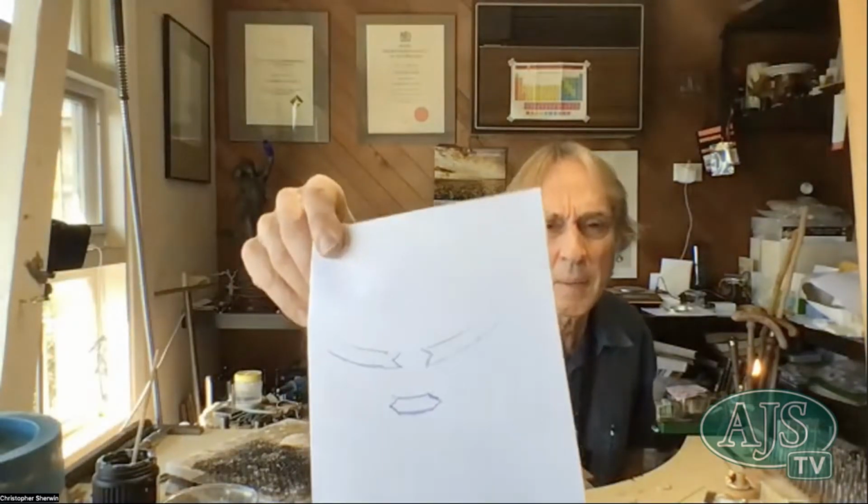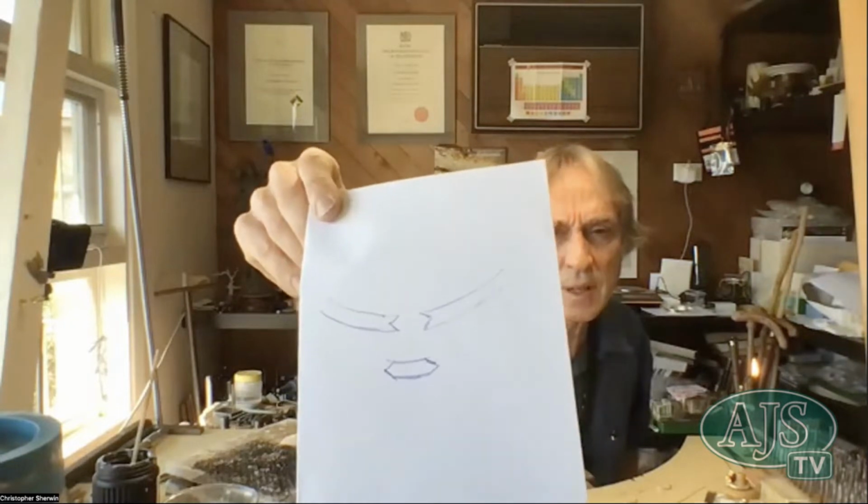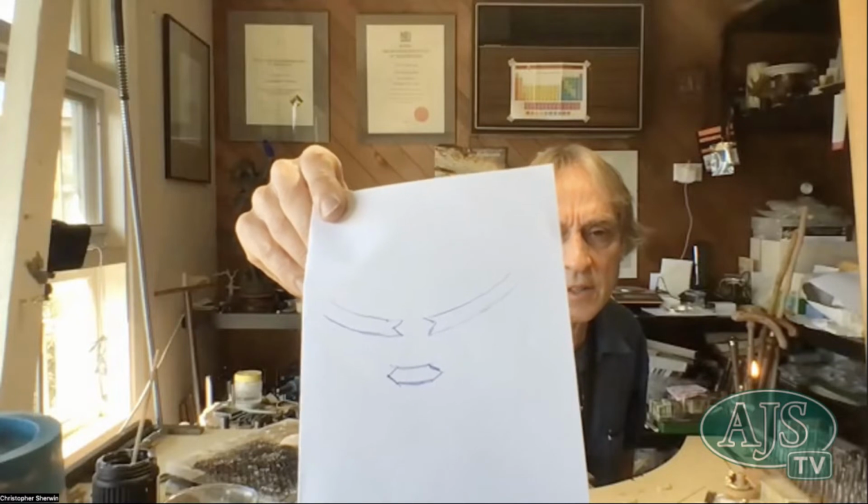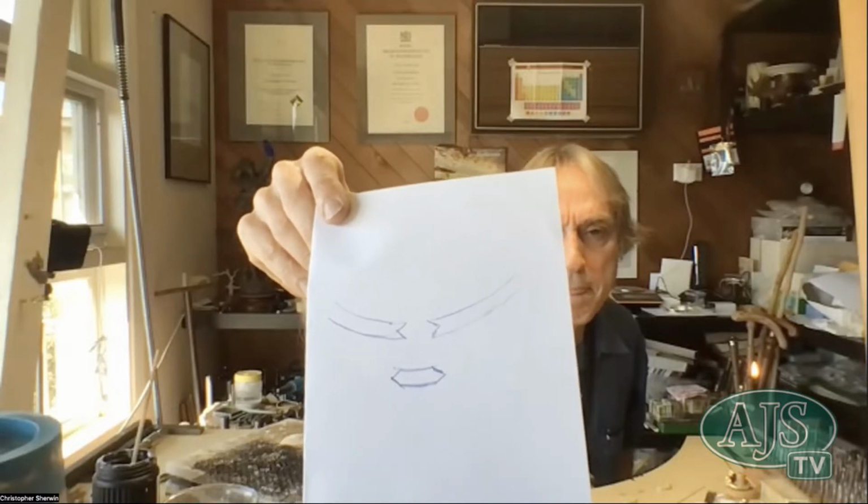I'll just show you the two sizes we're about to do. We'll do the little zigzag one first. This one is where we're going to cut a piece of metal and put a V joint, if you like, in the insert as well as the band. Hope everyone can see that. We can. We'll do that one now, and that helps lock the metal into your band, so you don't have to have binding wire or anything holding it. You're actually using the physical shape of this V rather than just a straight bit of metal that can fall out when the ring gets hot.